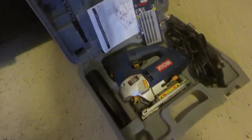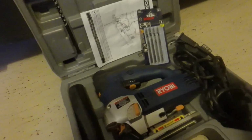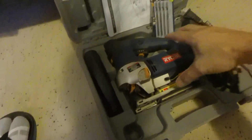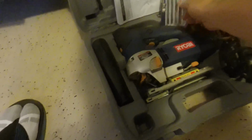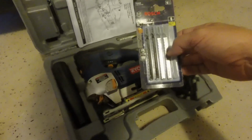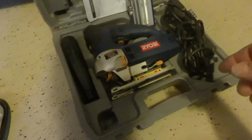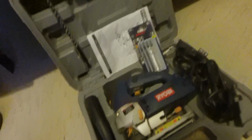And some of the other cuts that I used for some of the smaller cuts and some of the weird angles and the pieces that I had to go around the baseboards, I used the scroll saw or the jigsaw, and I used Bosch blades, just wood blades, 10 teeth per inch on those, and that works really well for those weird cuts.